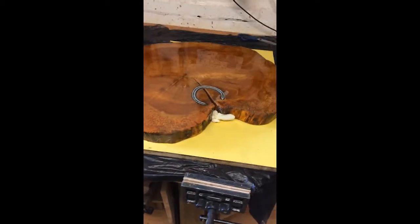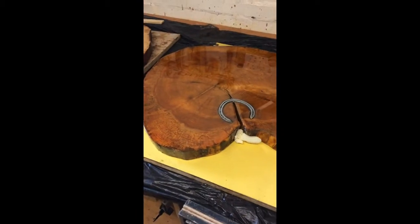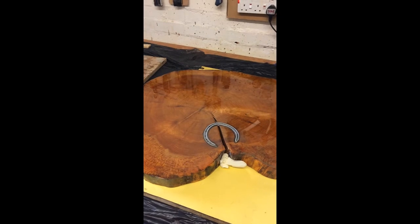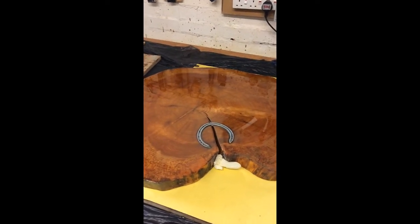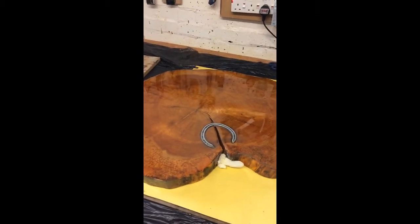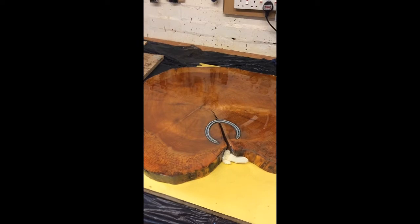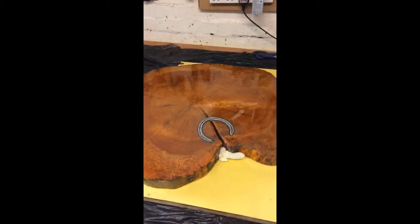At the split in front of the horseshoe I've got a bit of an unused surgical glove just pushed into the end there, because I don't want all the resin running out. That's enough to hold it without sticking, and that tiny little bit I'm going to tart up with some finishing oil so it doesn't look different to the rest of the table or the split. So that's that one.